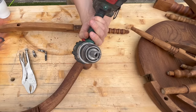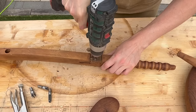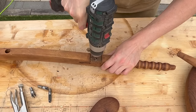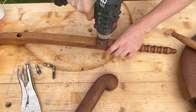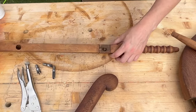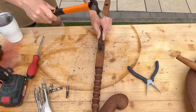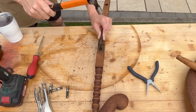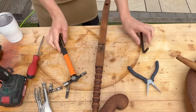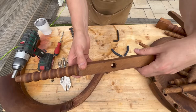I had to break the screws at the beginning of the video because I couldn't get them out. This tool is used for making plugs or short dowels, so I'm basically removing the wood around the screw to make it easier to get it out. Then I'm going to plug the hole with a new dowel just to make it strong so I can actually put a new screw through it.